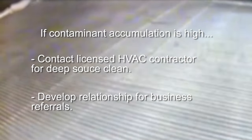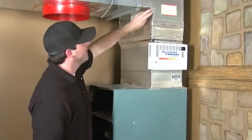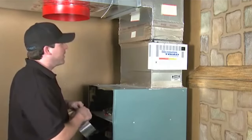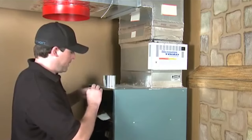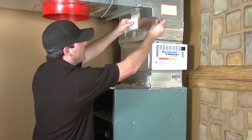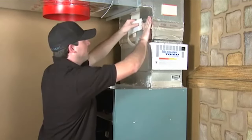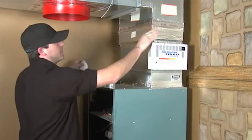While at the air handler, inspect the ductwork throughout the system and look for any cracks, tears, or ducts that are pulled away from the registers. Any mild and minor repairs can be accomplished with aluminum foil tape, which is easy to use and apply. If this improves the efficiency of the air handling unit, most homeowners would be happy to pay for this service.